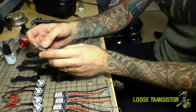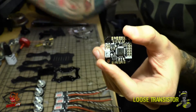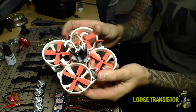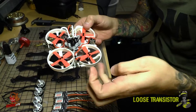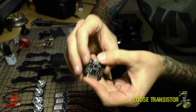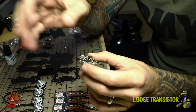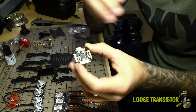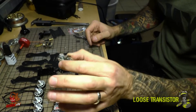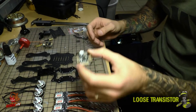The brains of the 3-inch build are going to be powered by the Pico BLX by Furious FPV. I've already done a build with this one when I built the Doinker, so we're using the exact same flight controller on the 3-inch build. Having flown and built the Doinker, I find this FC to be quite impressive. It's only a 20x20 millimeter board, it is a full PDB as well as a full flight controller, supposedly able to handle 2 to 6S — quite impressive for something this small. The 3-inch build is going to be a 4S build, so we'll be pushing the limits a little. This board is a full F3 chip and I'm able to run 8kHz/2kHz PID loops on it, which is quite good for tuning.